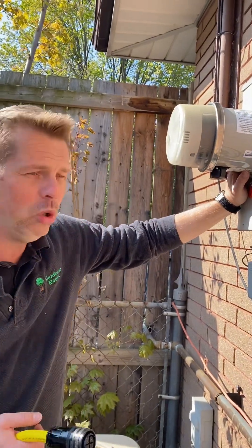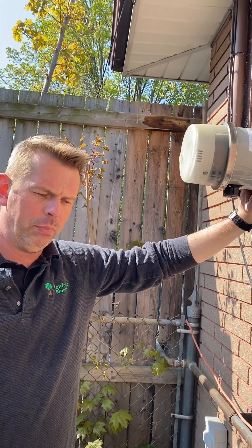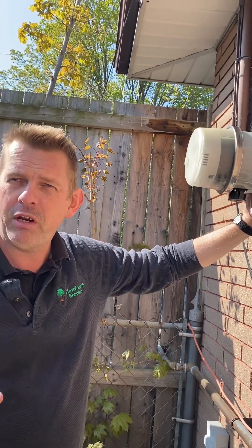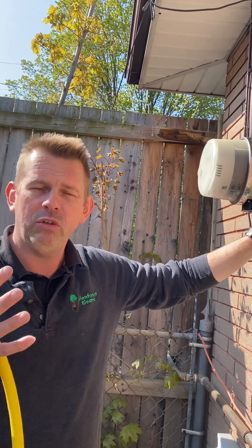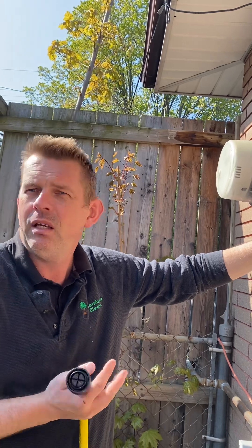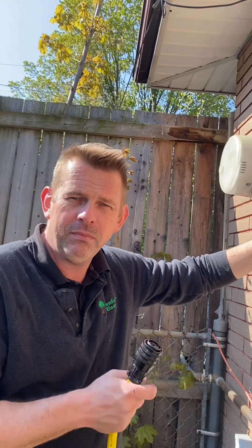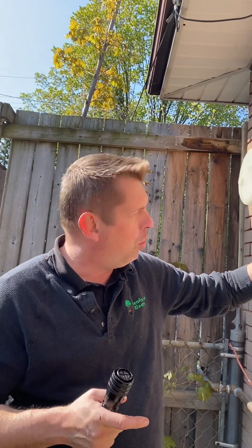We have a light called 'Load Limits,' which tells you that you're approaching 30 amps of current — that's all this unit can handle. When the power is normally on and the generator is not plugged in, it doesn't matter if that light's on because you have 100-amp service. If you're cooking a turkey, drying clothes, and the pool pump is going, you might be up to 60 amps — that's perfectly fine. But this light will come on.